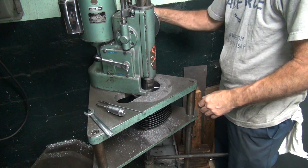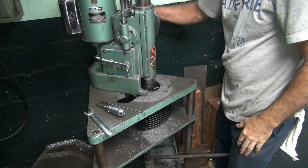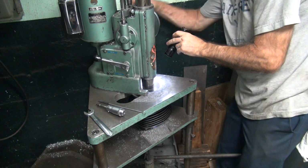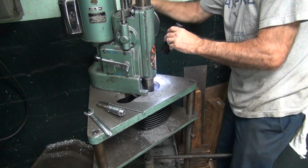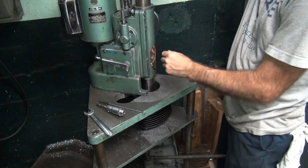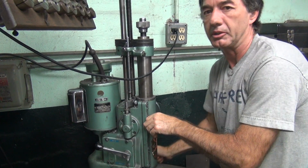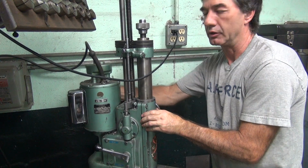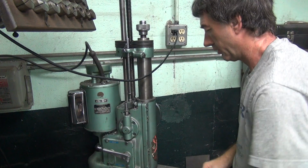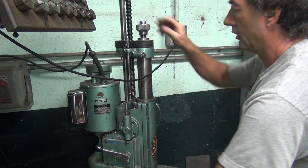Alright. So this is a 3-finger centering system over here. You have to center it out. You run it down your bore fairly far. Now this bore is all screwed up, so you got to be careful where you center off of. So leave it down low enough to get past the bad part. Looks good. So this expands your fingers out up here. You get a pinch point on the bottom over here you can undo. That lets this whole thing float, see? Just kind of expand it up, wiggle, let it kind of self-center, and tighten it down. And unscrew it.